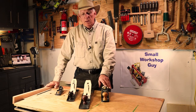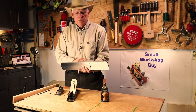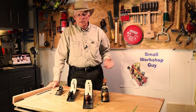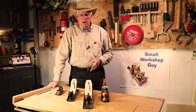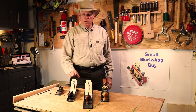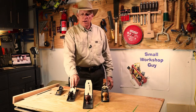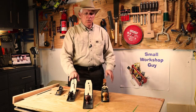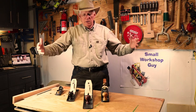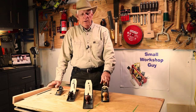Next, when you're ready to add more planes, you would want to get the number four or the four and a half smoothing plane. Then, when you're really flush with cash — because these monsters are expensive — you step up and get your number seven or your number eight. Number eight is wider and heavier, but the number seven is already pretty heavy; I don't know if I would go beyond it. The order you use these in your work: use the number five jack plane to get the board mostly ready, then the number seven jointer to get it level over a long space, then the number four smoothing plane to get it nice and smooth.